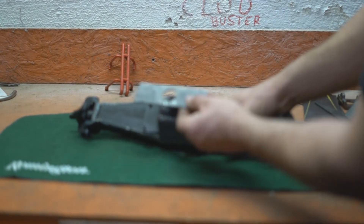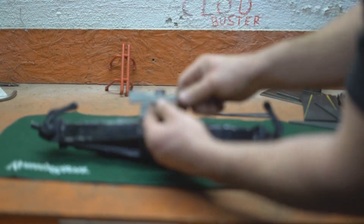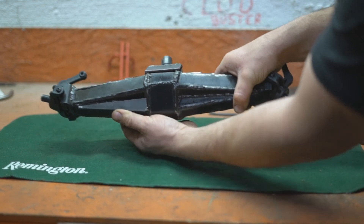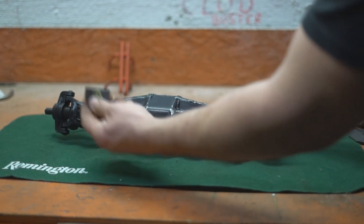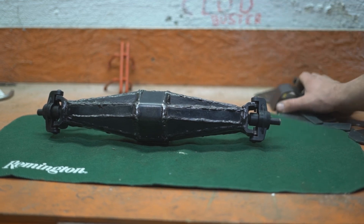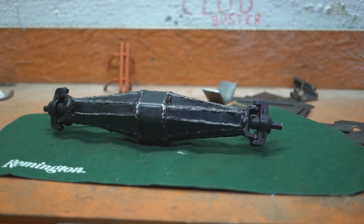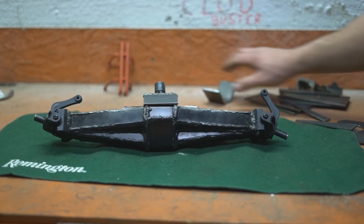Got this piece — that's right here. Edges fold down, there are some more gussets, and that's this piece right here. This right here is actually just the jig. When I build these axles or this whole chassis, I make a bunch of plates and jigs to mock up the parts and hold them while I weld, so I know everything's going to be positioned just right. So there you have it — there's all the pieces: the axle, fifth scale, steering axle, virtually bulletproof. I think the only weak link is going to be these outers, so I'll probably end up making some of those.